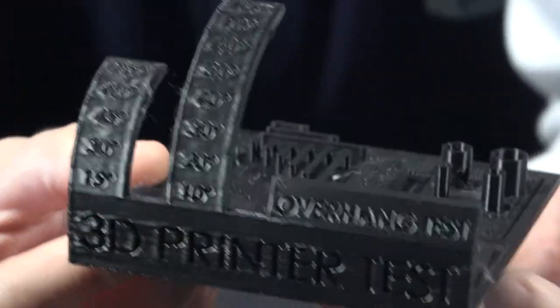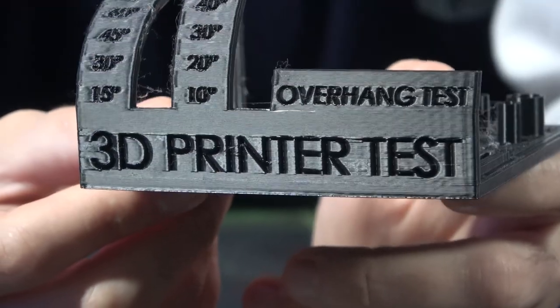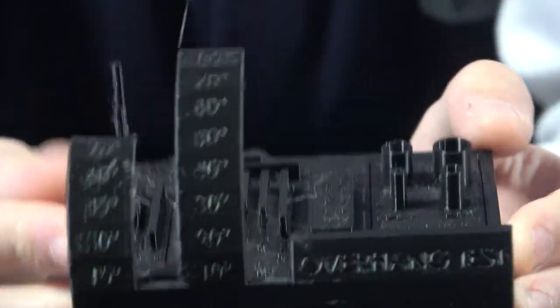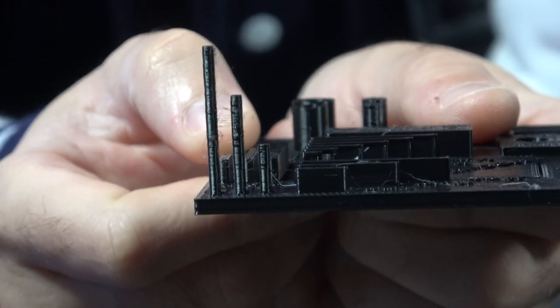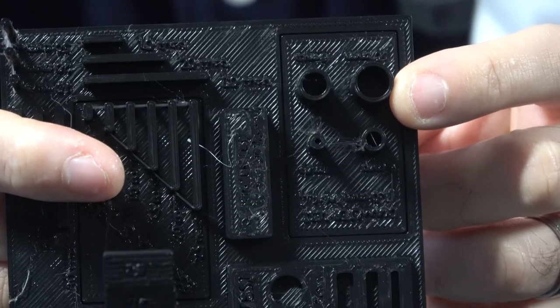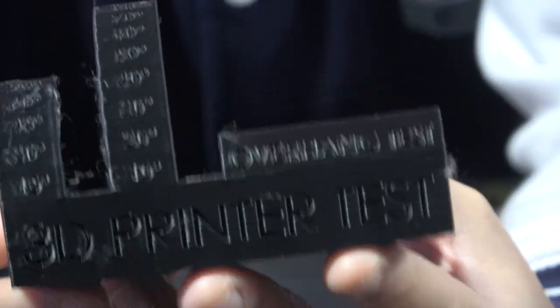This is the 3D print test. This was printed at 400 millimetres a second, and there's really hardly any — if any at all — ghosting on the front. Everything on the top looks great, done at a 0.2mm layer height. All the text has come out, all of our bridging has gone really well. The only thing to criticize is a little bit of fuzziness on the retraction test — just need to tweak that slightly. Unsurprisingly, it's done amazingly on the circles, and dimensional accuracy is bang on.